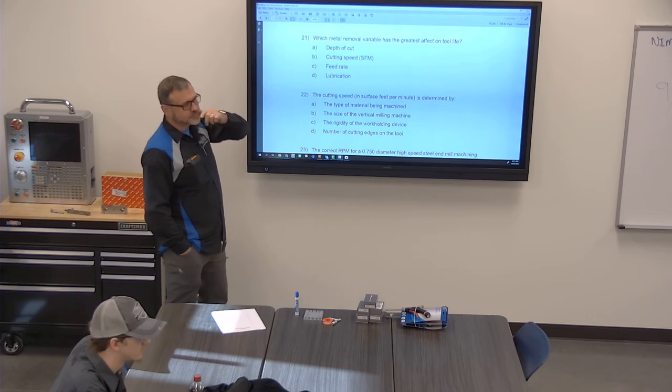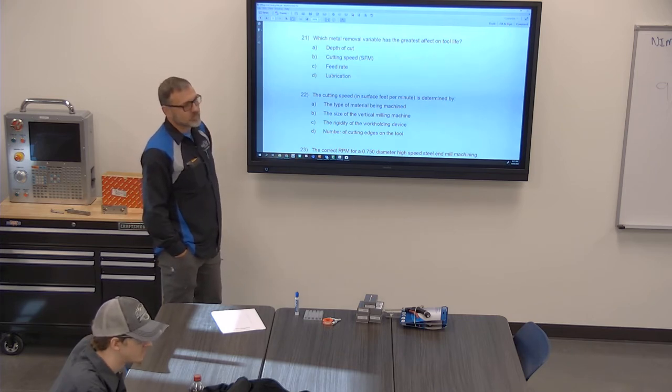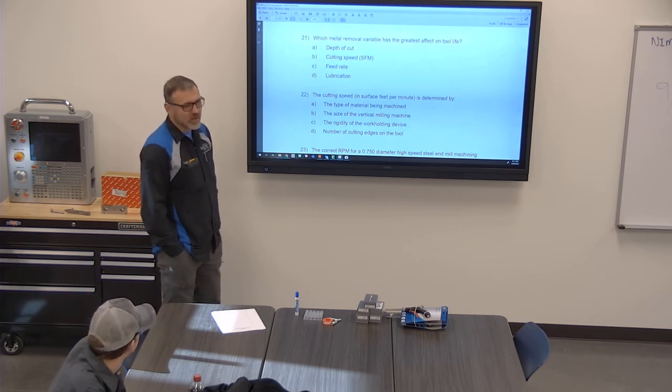I orange the tip of an end mill at one point. I was thinking too light a cut, so just rubbing. I guess I was being too slow, so just orange on high speed steel. Yeah, it can definitely just wear it to death, too.